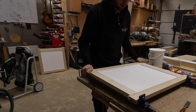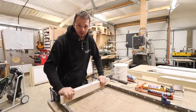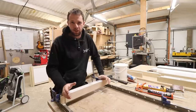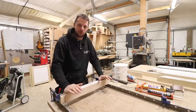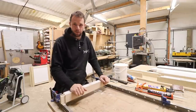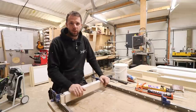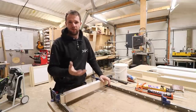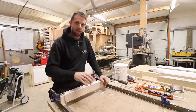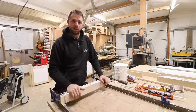Undo the clamps and that job's done. I hope you found this one useful. This technique is literally useful for anything you're gluing up — whether it's stud work that's being painted, door frames, windows, casement. If you've got that internal corner but you don't want glue squeezed on it, put some MS polymer adhesive on it and clamp the joint together — that will prevent the PU glue from squeezing in that direction. It also provides a perfect sealant to then clean off and get a perfectly corked internal corner that you can paint over. It's really helped me, improved the quality of my joinery, and sped up the process as well.